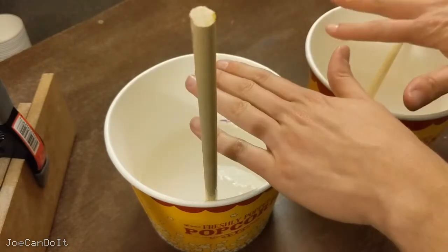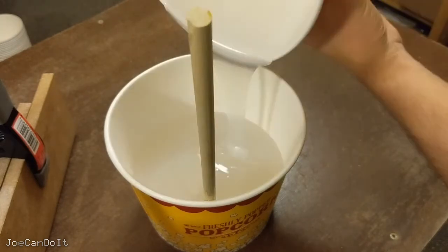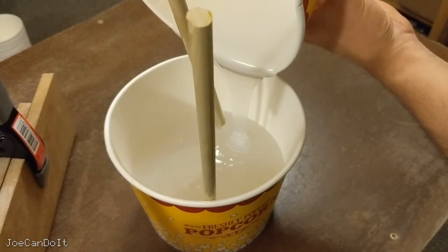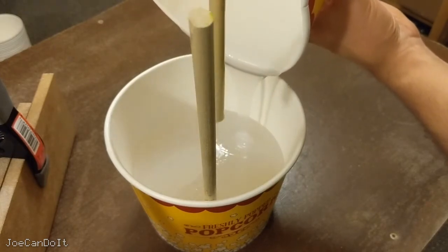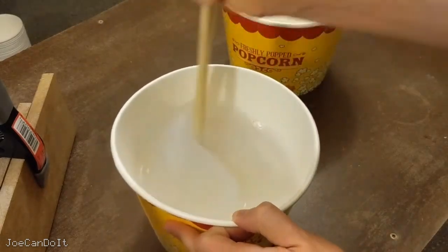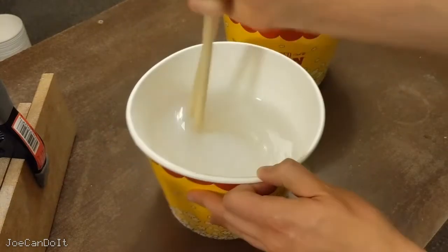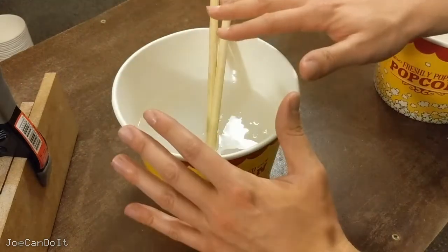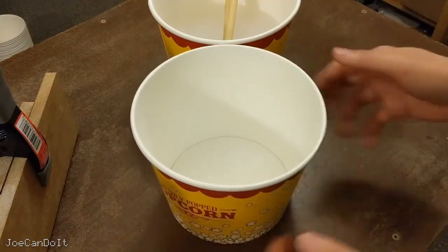Once you have both Parts A and B in separate containers, pour one into the other and mix them together. Make sure you scrape everything off the side walls into the bucket — if the parts aren't fully combined in equal amounts, your silicone may not cure. Stir for about a minute, though I go for five minutes to make sure it's totally mixed. After mixing, I pour into a second bucket and mix again to make sure I've scraped everything off the bottom and sides.